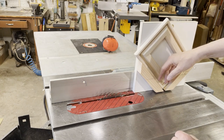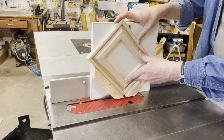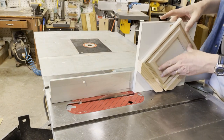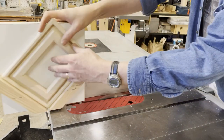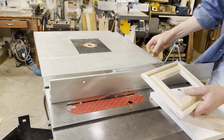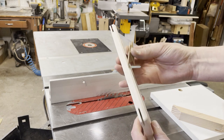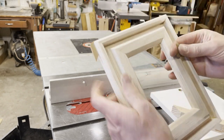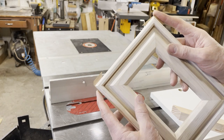All I've got to do is make four passes. I'll show you how it works. If you take a look, you'll see that I've got four identically cut slots in the frame. I've got some splines — all I need to do is glue them in, and my frame will be significantly stronger once they're glued and everything is trimmed in place.